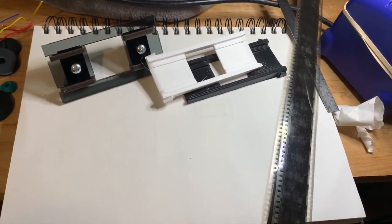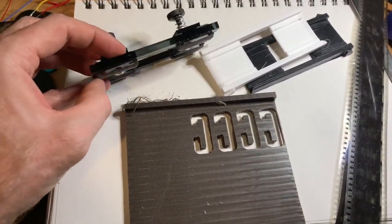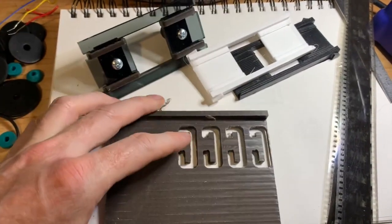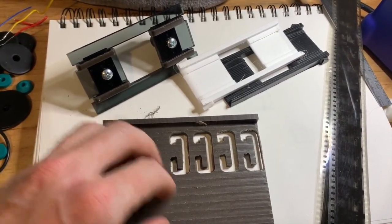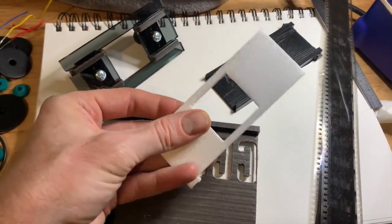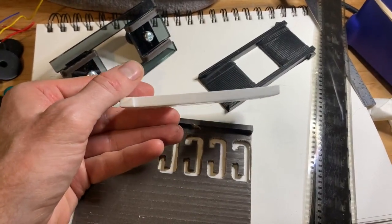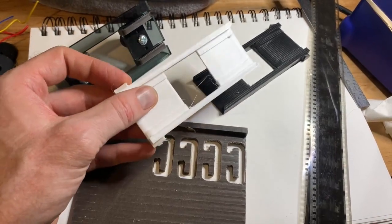The last material is related to the gate and these rails as well. This is also Delrin, but it has oil infused into it, which is self-lubricating — which is nice. Although it is really nice, maybe it's an upgrade material you could order from me in small batches, or I'll make them available that way. The company that makes this is IGUS — they are based in Europe but also have shipping facilities and representatives in North America and I think Asia too, but I'd have to check their website.